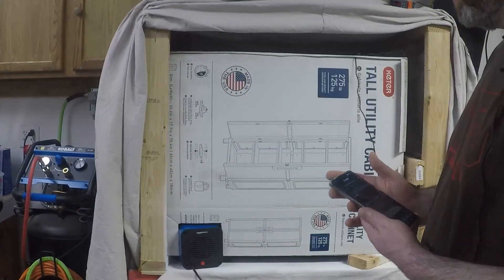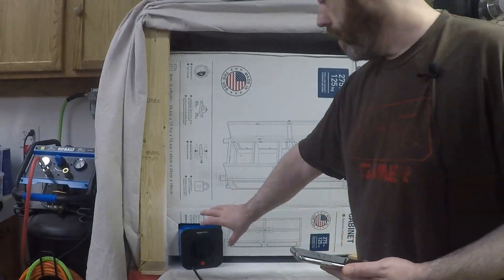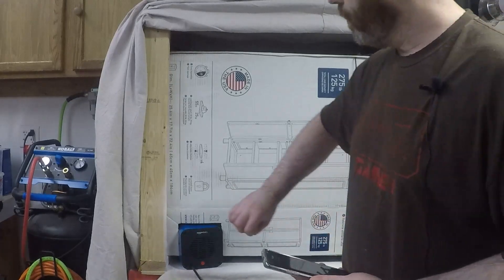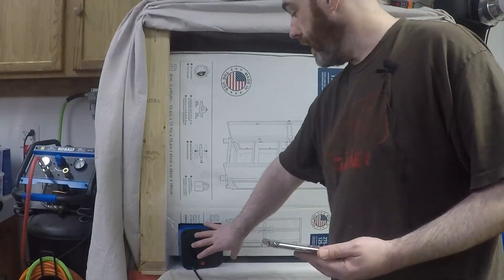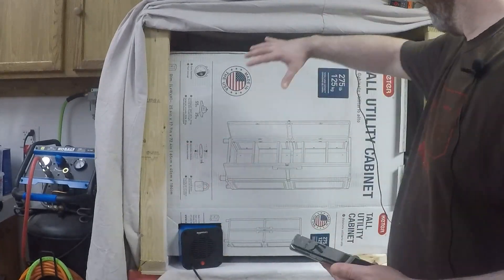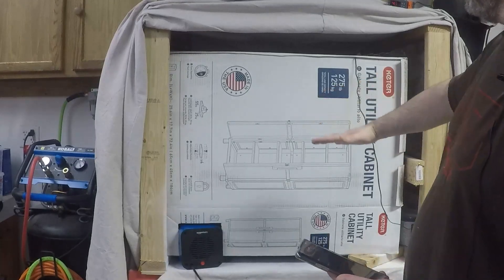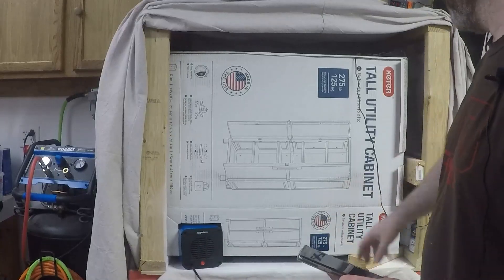I have measured — this is 144 degrees Fahrenheit, 62 Celsius, the temperature of the air that comes out. It's always pulling fresh clean air, no solvents, and no heated air, so the temperature it outputs is stable. That blows up against this wall and it just kind of rolls around here, and the hot air tends to rise more and push the cool air out the bottom.